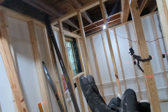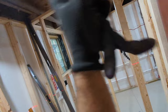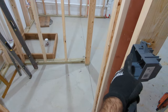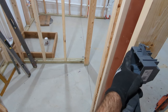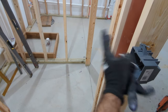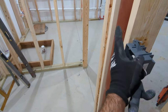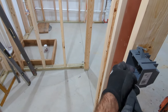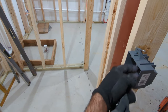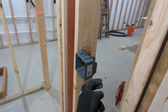We don't have to put a fan in for this, and it'll be easy enough for somebody to add in the future, but I might wire it over here. I really like to see the fan run whenever the light comes on. That way, it doesn't hurt anything, and people are either pooping or taking a shower or washing their hands. It's on and off. It really isn't an energy suck, but that way people always have the fan running when they're doing anything in the bathroom, which is when it needs to be on. If you give them the option to turn it on or off, people don't like to listen to it or don't remember, and then there's no point in having the fan because it's never used, and the room gets all damp and whatever else.